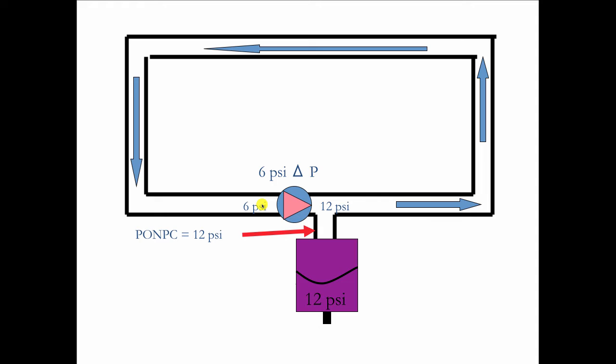Imagine what's going on in the top floor radiators that may have some air bubbles in them. If you remove this pressure, suddenly the pressure on the air bubbles also drops. So the air bubbles, when you remove pressure, the bubbles get bigger. Right? That's Boyle's law. You remove pressure on a gas, it's going to get bigger. You add pressure to a gas, it's going to get smaller. So this was what was causing the corrosion of the boilers back in the 60s, and the engineers realized it, and they moved those big pumps to the supply side. But it never really caught on until recent years in the minds of the people that do residential work and commercial work. But this is what's causing your air problems.